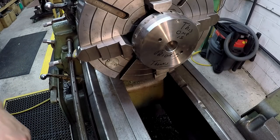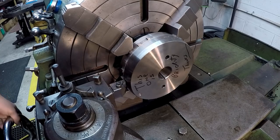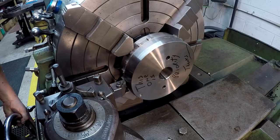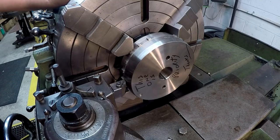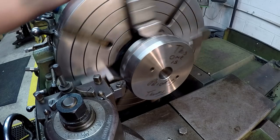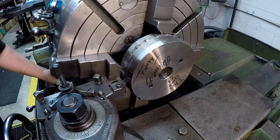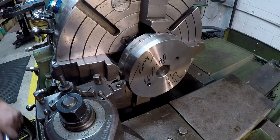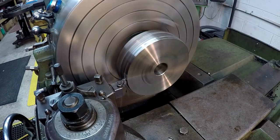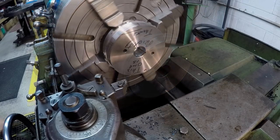Let's go ahead and set up a tool and start cutting. What we're going to do is crank the carriage up and touch the tool next to one of those machined divots very lightly. I'm going to use my indicator on the ways, preload it just a little bit, back the tool away 15 thousandths, then rotate it by hand to make sure everything will clear. Then reset the indicator to zero — that's where you'll stop your cut. Once I finish turning the OD, when I come up to that face for the last time I'll feed in an additional five thousandths and face it back to clean it up, which will put us ten thousandths away from those machined divots.